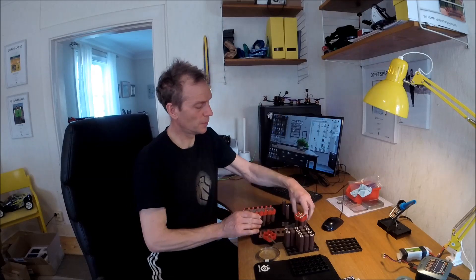So after some googling around, I found these other systems, also on AliExpress from a Chinese supplier. You join the batteries with these plastic pieces, red and black, so you can separate plus and minus easily. And you join them together with these pre-made nickel plates, which are all 0.2mm in thickness. You spot weld them on like this and then build your pack. Each cell you then connect with these copper plates, and the area that connects these cells together is 18 square millimeters.